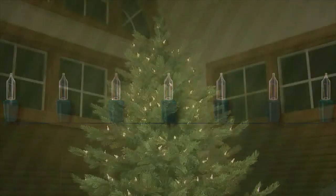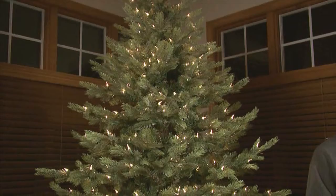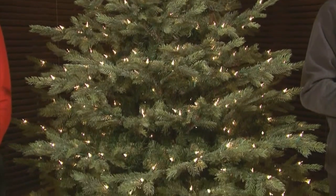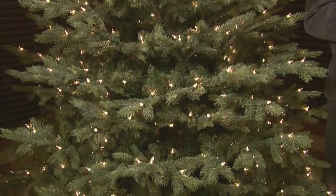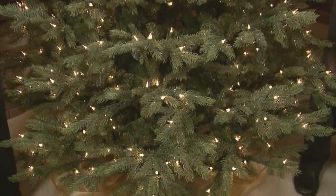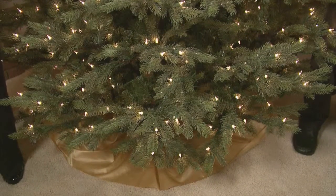The best way to maintain the longevity of a light set is to replace burnt-out bulbs as soon as possible. And remember, the majority of light set malfunctions are due to bulb failures, not failures in the wiring. The only time a bulb is not to blame is if the wires are severed or pulled from the bottom of the bulb socket.